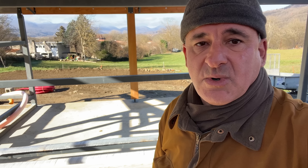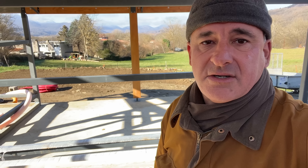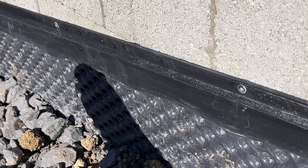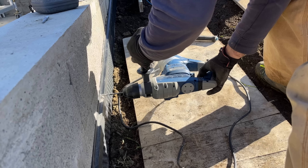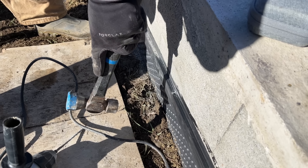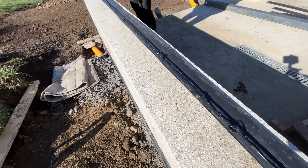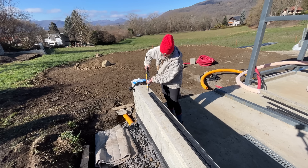I better go and find my drills. We're going to put up these weather strips on the plastic membrane, then finalize the French drain, get a load of pea gravel down, and get back on the digger and fill it all in. These are the plastic strips that we put on all the way down the back. I was nailing them in with little concrete nails and they're not very good at all. Julie's just putting this Sikaflex rubber, this waterproof sealant, on the back before we put it up to give a little bit of extra protection — this is just stopping the water running down the wall.